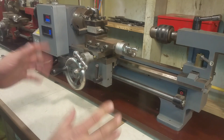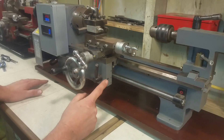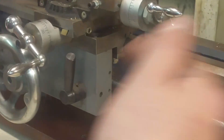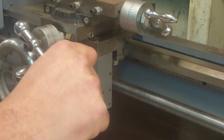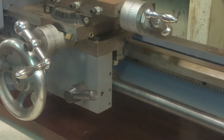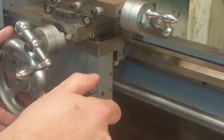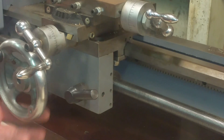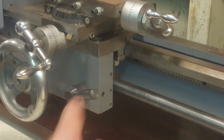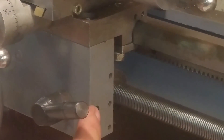The only few adjustments that I know: there's this Allen head screw that goes in here, and there's a spring with a ball. There are two detent points — disengaged, which holds it open, and engaged, which holds it closed. Now, when you do close it, if you're not exactly on the thread it won't close, but if you give it just a little bit of movement it will close on the nut. The tightness of that screw is one setting.